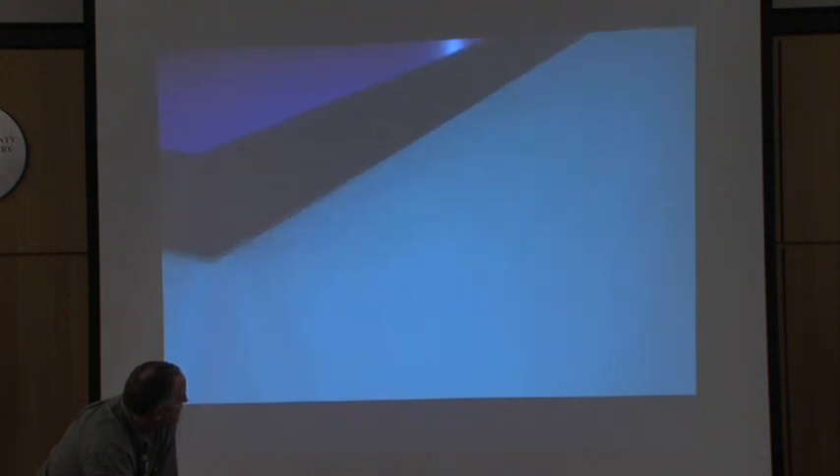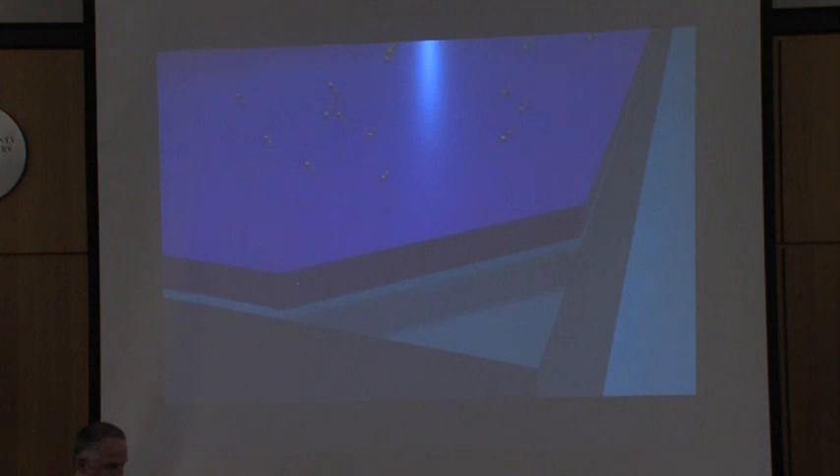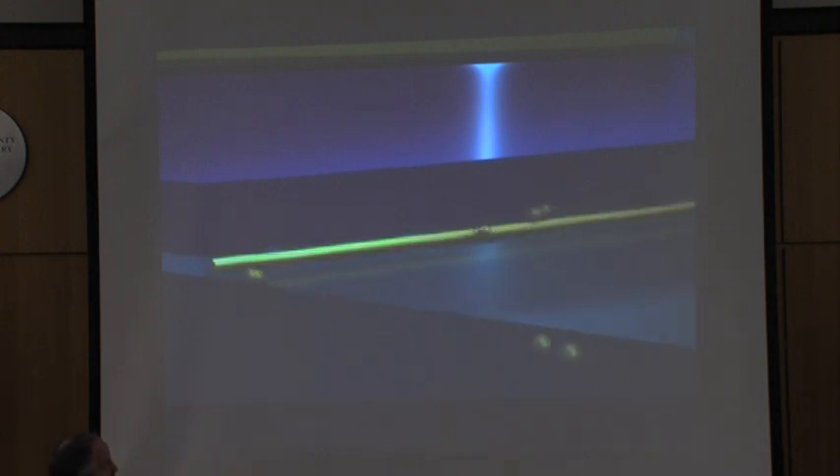Zooming in to see the detail, there are two layers of ultra-nano-crystalline diamond, also known as UNCD, over a silicon wafer substrate. The upper layer is insulating so that any ions from the metal solution that impinge upon the surface can diffuse away and will not self-assemble into solid deposits. The underlying material is made from conductive, nitrogen-doped ultra-nano-crystalline diamond. Only the edge of this layer, and not the top surface, are exposed to the solution so that when the potential is applied, metal ions that contact the nano-electrode layers are reduced, forming metal wires at the edge of the conductive layer.